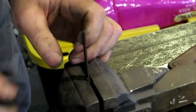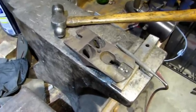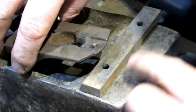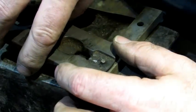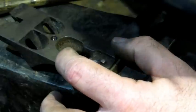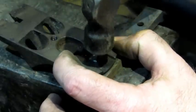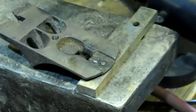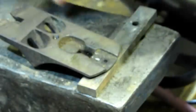Next I'm going to take a light hammer and a punch and knock the pin out. What I have here are the jaw faces I removed to put my wood jaw faces in. I'm using that hole and lining the pin up over top of it. Taking a small punch, you can start it just with the light hammer and finish putting it through with the punch — and it fell through on its own.